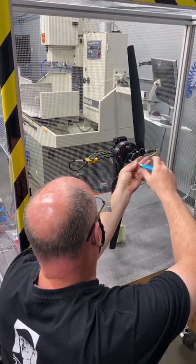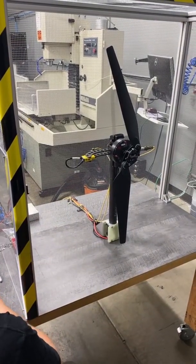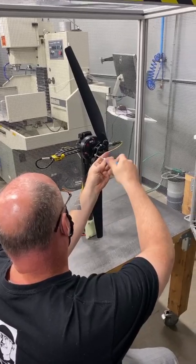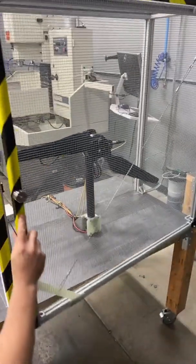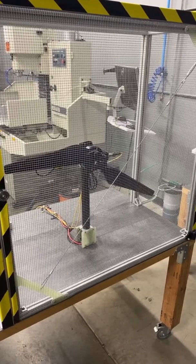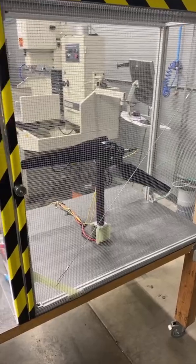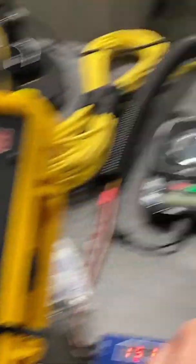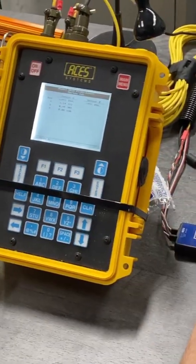Why test in the vertical position? I don't think there's a big reason there — that's just for convenience, and also from a safety perspective. We do this for every prop assembly — every active blade assembly and prop goes through this process. So every Alta-X that we ship, every prop on every Alta-X is balanced in this way.